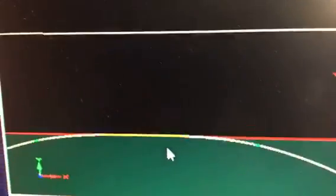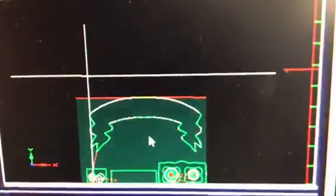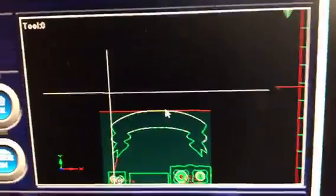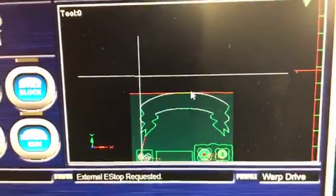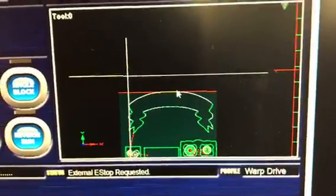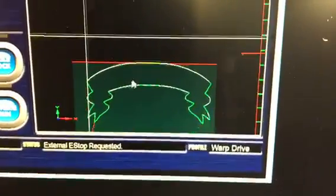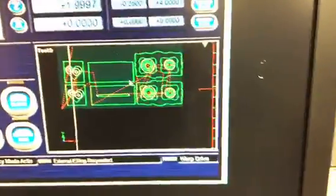If I'm close to the edge, I'll see where the cursor is. In this case the cursor is off my workpiece, but I was really worried about this top edge. When I jog the machine to position, this line comes down near where the bit will be, and if the bit gets close to the clamp, I know to move the clamp. I'll jog the machine around to different places on the part just to make sure the clamps are not in the way.